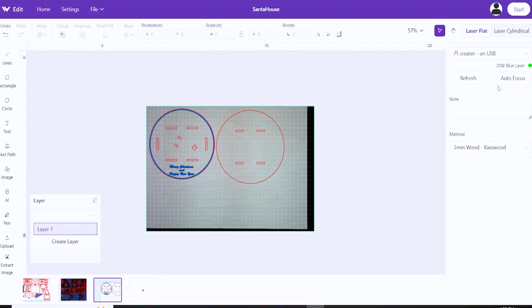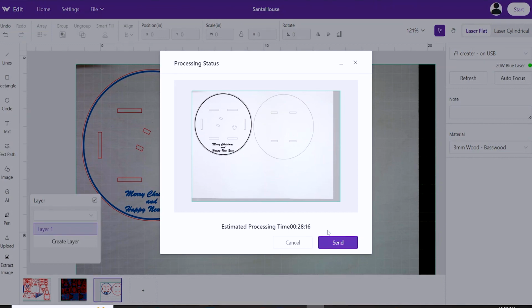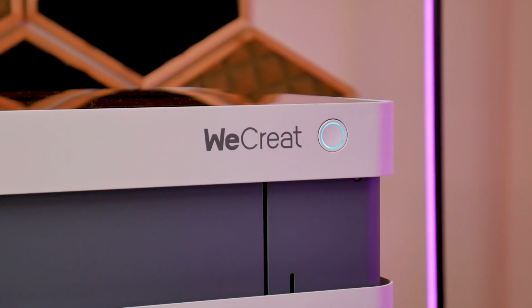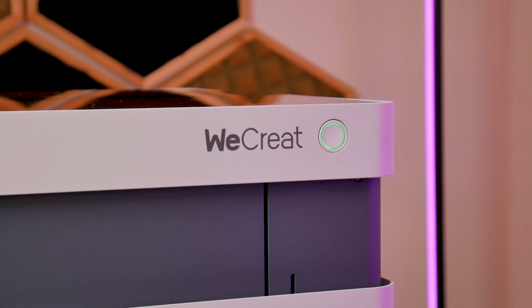And so I've loaded in my 12 by 16 by 3mm thick piece of birch, and I'm going to press the autofocus button, and the machine will autofocus the laser to the top of the workpiece surface. And in the background, you'll also see the workpiece itself using the onboard camera. I'm going to press start, and that's going to send this job to the WeCreat Vision, and all we have to do now is press the button on the front to confirm that we want to run this job.